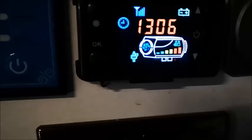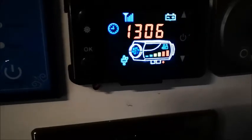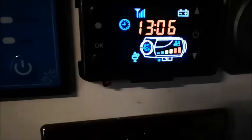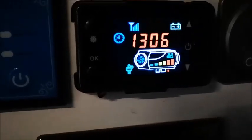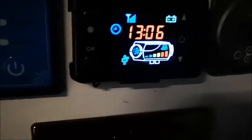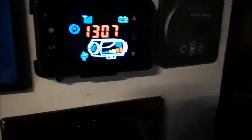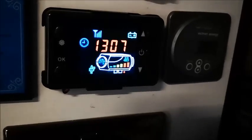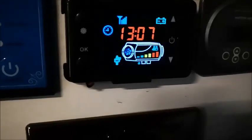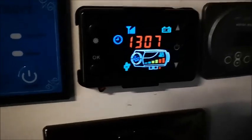It's quite a simple process. I ran it for an hour on each setting to see if it would throw one of these red lights, but it didn't, so I'm happy with that tuning. I thought I'd put this up to help anybody running their diesel heater at factory settings, because this is definitely a fuel saving — and over time that's going to save quite a significant sum. The next clip you'll see will be of a late-night visitor. I'll apologize in advance for the language, but you'll get the gist once you watch it. Thank you very much for watching — enjoy the next bit, it's certainly made me laugh.